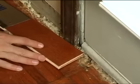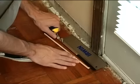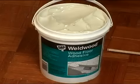Again, remember that the end of one plank should be at least 6 inches from the end of the plank in the next row. Use a scrap piece of flooring to mark any jambs that need to be cut. Doing this now, as opposed to after the floor is laid, will save you a lot of trouble. We'll be using an adhesive specifically made for the installation of wood parquet and plank floors.